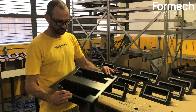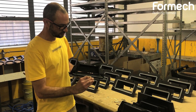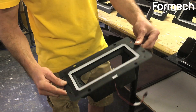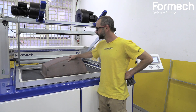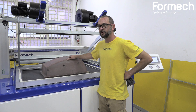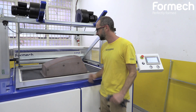You get beautiful blanks like this which are then very easy to trim to create a beautiful finished product. This is one of the prototypes we've been working on for a cash-accepting ATM. We're going to be trying a couple of the features on the Formec machine with the pre-stretch and the auto-leveling, just to get the temperature right and the stretch nice and even over the mold.